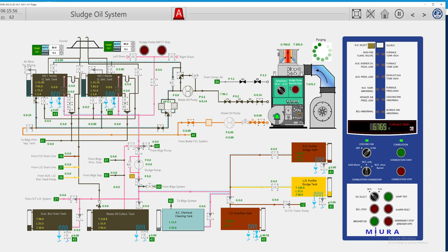Our incinerator has cooling fans installed with passages through the furnace wall — air is circulated and cools down the surface and the bricks inside. This helps keep it cool and integrated, because the heat — as we can see now it's 676 degrees — can melt almost everything. That's why specific furnace bricks are used to help keep the incinerator in good shape.